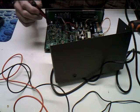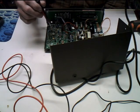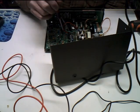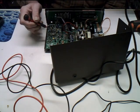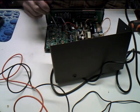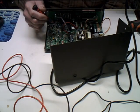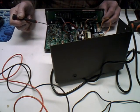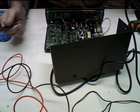This transmitter has all of the prerequisites you need — it's a PLL circuit with mixing for frequency, it's all frequency agile as we saw. Almost all of it comes as a kit with through-hole components, except a couple of parts are already placed for you — some surface-mount parts are pre-installed. But you get to put all the rest of them in yourself. As I said, the problem with this one is it is not transmitting very well, so we've got to figure out what's going on with it.